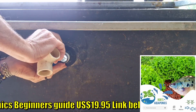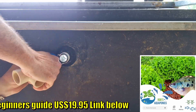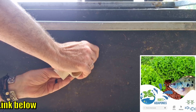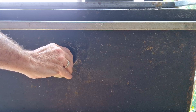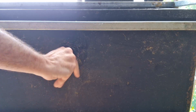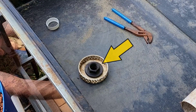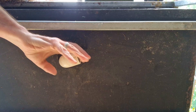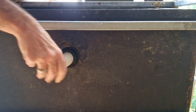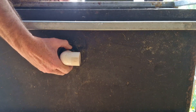Just to make sure she's watertight. It does help if you wind the tape the same way as you would wind the fitting on, so that way the tail end doesn't get caught. Because I'm spinning this on the same way, it won't undo the thread tape — it will make it nice and tight. You can see that tail is moving, so just hop up the top here. Because I haven't tightened this nut all the way down, I can get this on as firmly as I like, and even if it's pointing the wrong way I can swing it around and then tighten up that nut underneath.